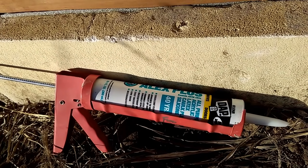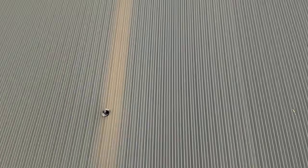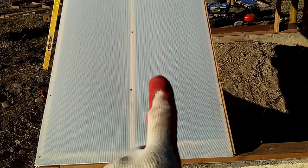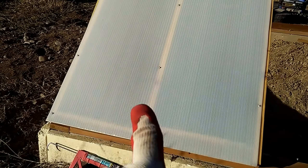You're going to need a latex caulk, 40-year. I use an acrylic latex — it's cheap, goes on white and turns clear so you can see what you're doing, and it's much less messy than pure silicone. This is an acrylic latex with silicone, and they're only two bucks a tube. You have to caulk the ends to give it that R value — it would not be the same R value uncaulked. The screw spacing is not critical as long as you have good attachment. The product itself, Solex, is 49 and 5/8 inches wide — a very strange dimension — so you need custom joist spacing with centers at 49 and 5/8 instead of 48, and you need a center joist on the 49 inches at minimum.